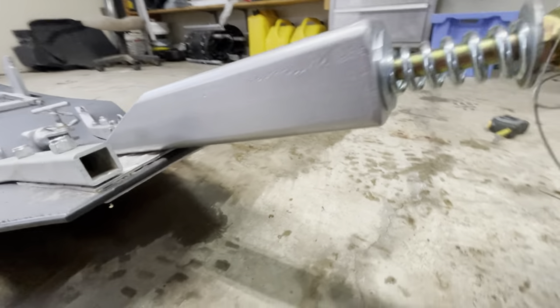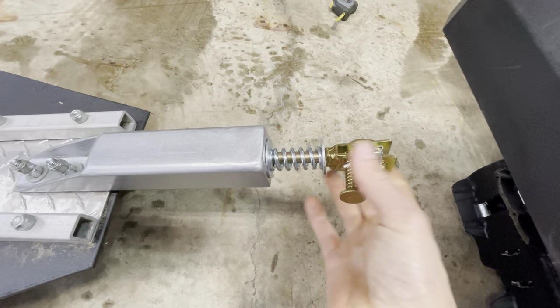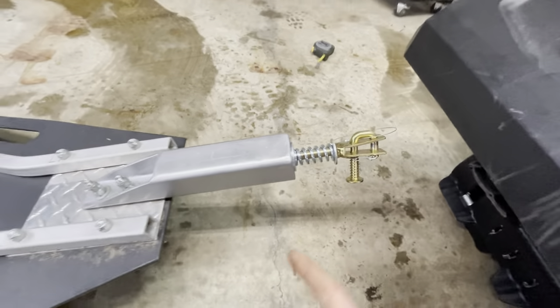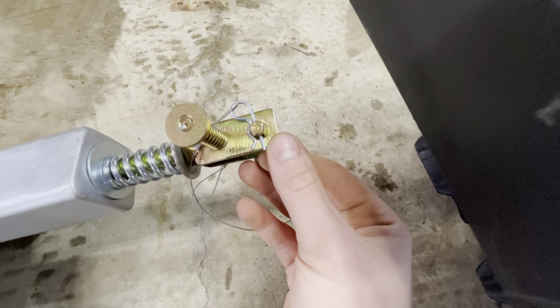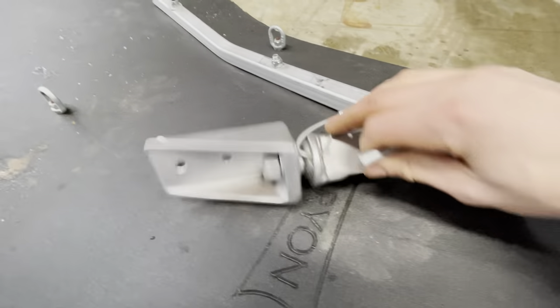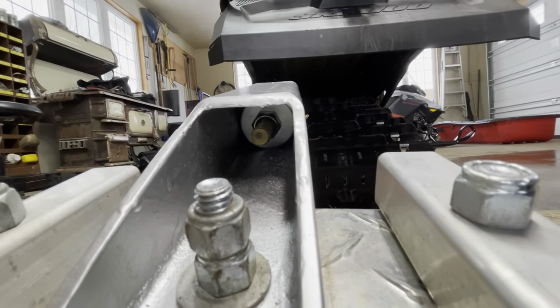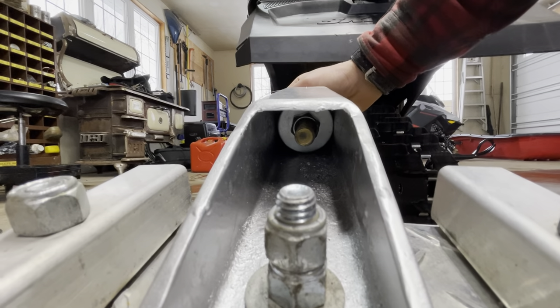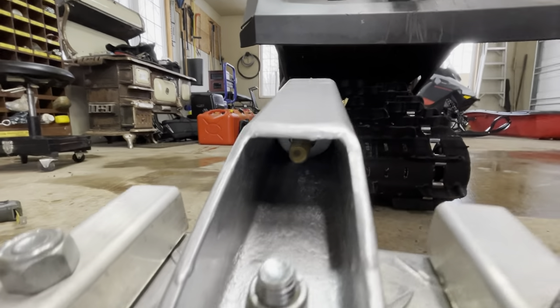Here's a close-up of the spring hitch — it finished up pretty good. I took a little bit of pride in building this and painted it up. In theory you have two inches — they're stiff springs — but you can shove it in or pull it two inches without the whole load moving, to help align your hole. It's got a nice R-clip, spring-loaded and self-supported on either side. It's a little lighter duty on this mechanism, but we'll see how it holds up. That big washer that it comes with actually takes up most of the room in that square tubing.